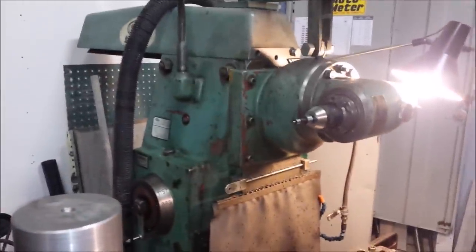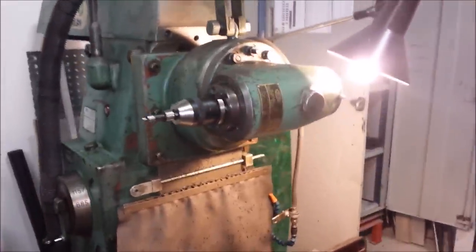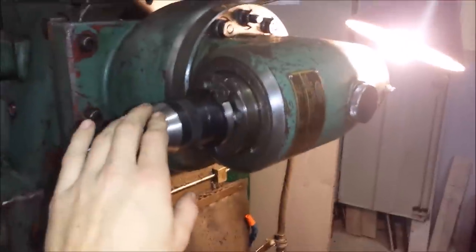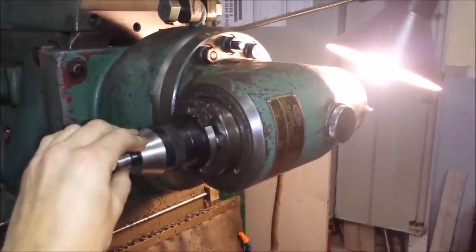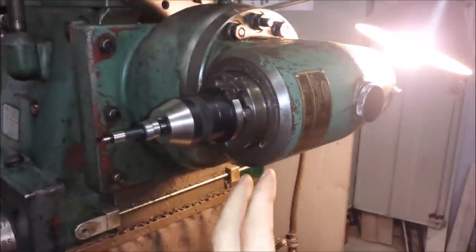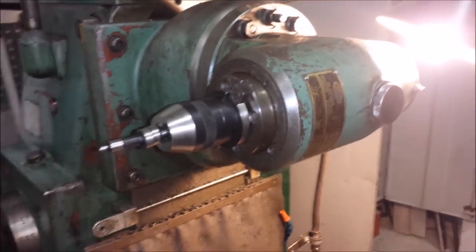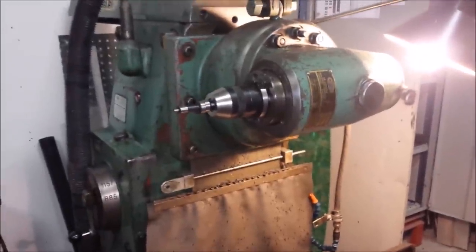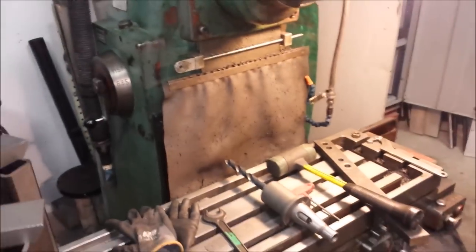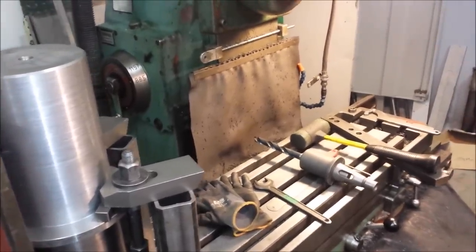Yeah, this is an old Swedish made universal milling machine, so it's pretty nice. It's a bit noisy in the angle head here. I recently had all this apart and changed all the bearings because someone didn't put the lock washer on, so the bearings were shot, and therefore it all was shaking, and the angle gear got messed up. So it's pretty hard to find the new gears, so it's a bit noisy. But otherwise, it's a very nice machine, and the ways are in good condition. It's tight, and it has the precision left in it.